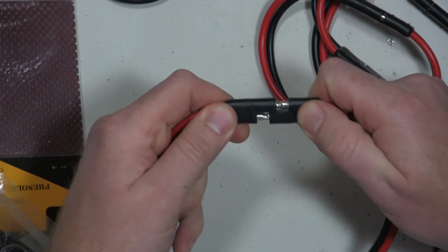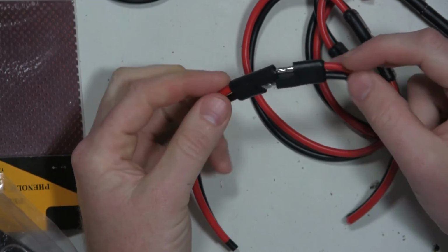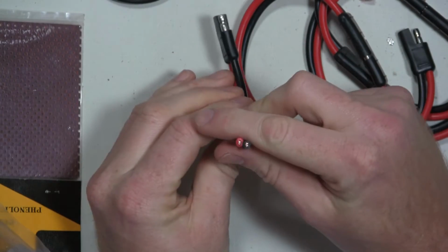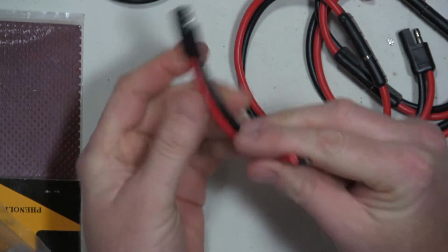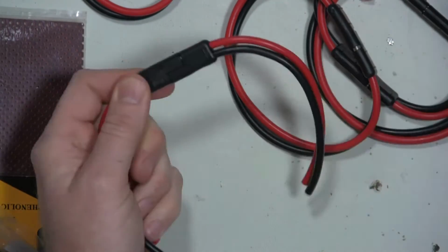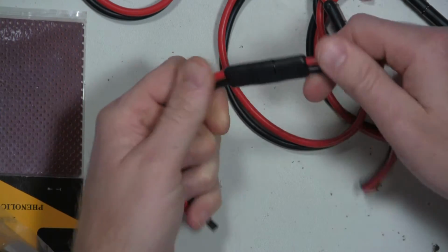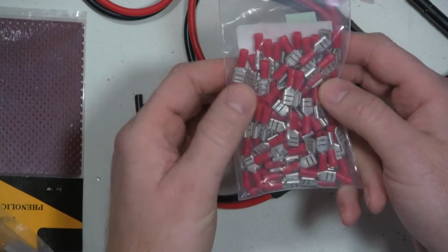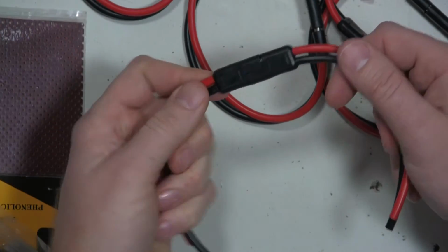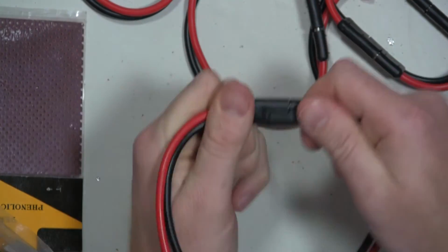And if I need to disconnect it to relocate it or change the panel, I can use these types of connectors. This is a heavier gauge too. I think this might be 14 gauge. These are only a couple bucks a piece. And I like using these for exterior locations or for locations that have a lot of vibration, where these quick disconnect connectors will easily come apart. I like these. They're a little bit more durable, and it seems like the connection is a lot sturdier.